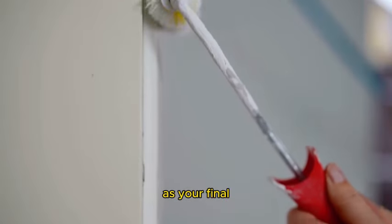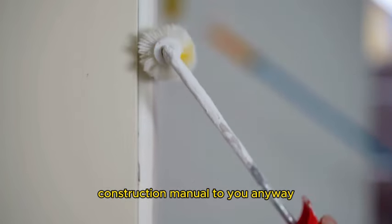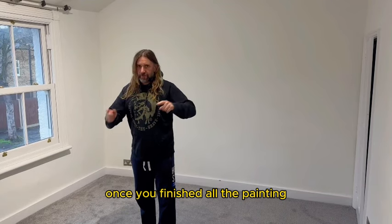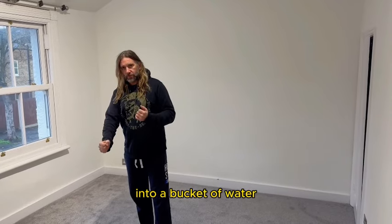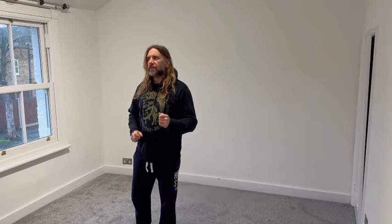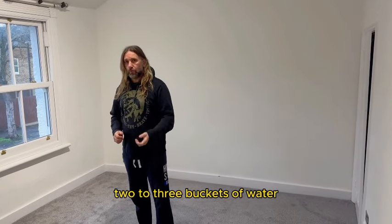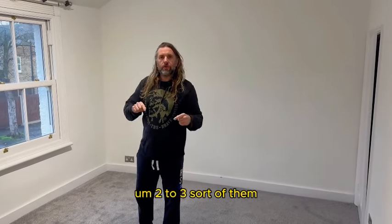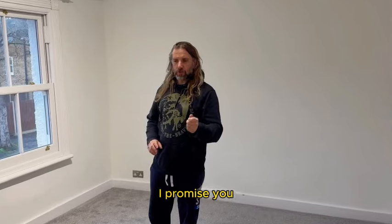With regards to sprayers, you'll find lots of YouTube channels telling you how to maintain them, and the instruction manual will tell you anyway. Once you finish all the painting for the day, the time-consuming part is you have to put the hose into a bucket of water and continuously spray until it runs clear. It can take up to 30 minutes — I do two to three standard buckets of water, just spraying to clear those pipes out, because if you don't, I promise you they will clog.